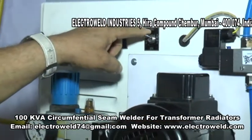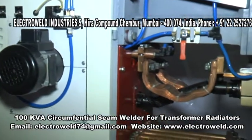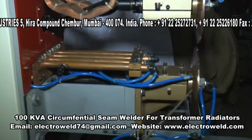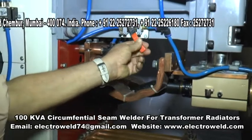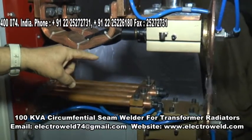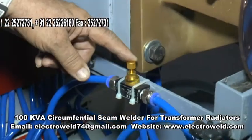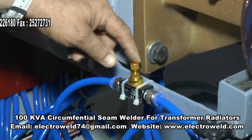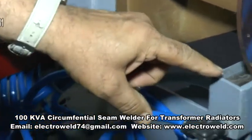Switch on both the pumps — you will see water flow from the secondary pipe. Water will also flow from here for cooling the bottom wheel. When you take this lever over here, water will keep on falling and cooling the seam welding wheel for welding. This over here is a water flow switch for increasing or decreasing the flow in this small water tank.